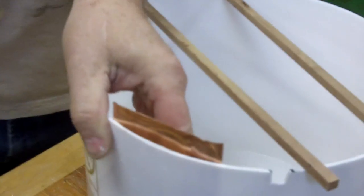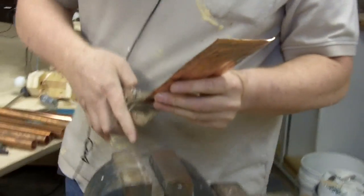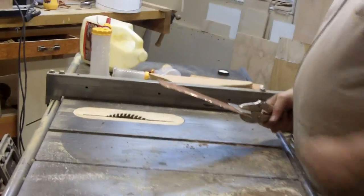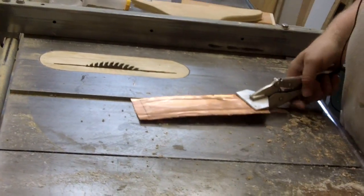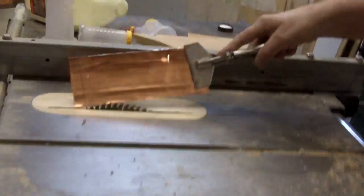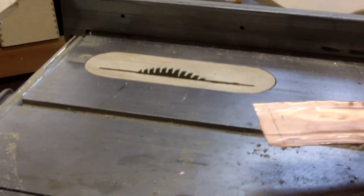I got it reasonably flat. It's going to go in the bucket - I'm going to put some tabs on that to hook it on the bucket. The nano-coated one's going to go around the other way. To get the tabs on there I'm going to put a line there and cut the tops down. When you're doing this you have to hold the metal really solid - you can't do this in your hands because if it catches on the blade you can get cut real bad. Grab it with some vice grips and make sure you have a narrow slot around your table saw blade. This is a special blade for cutting non-ferrous metals.